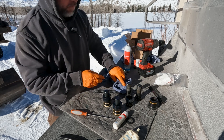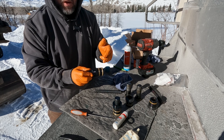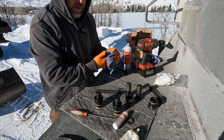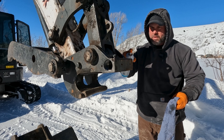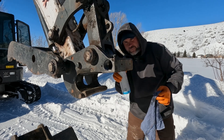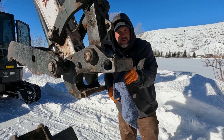The only one I had to redo actually broke. To get the bushing out when you have the bearing mount on it, you just heat it up with a torch and it'll liquefy that bearing mount again so you can back it out. So it's not permanent, but it helps for sure to keep it in place. Before I put that bushing back in, I want to make sure these threads are clean and dry - not soaking in hydraulic oil - anything that'll mess with the Loctite. Just a little brake cleaner and a rag is all it needs.